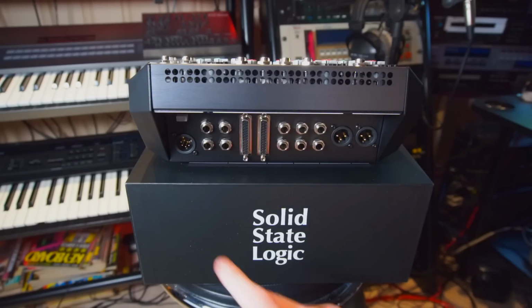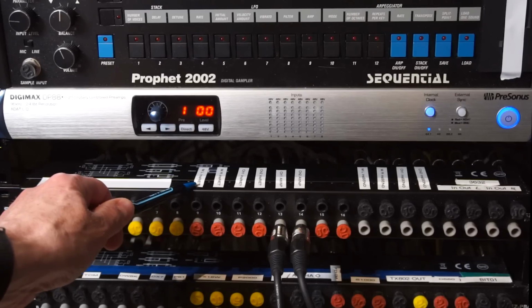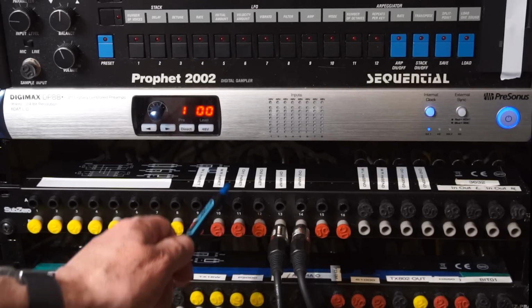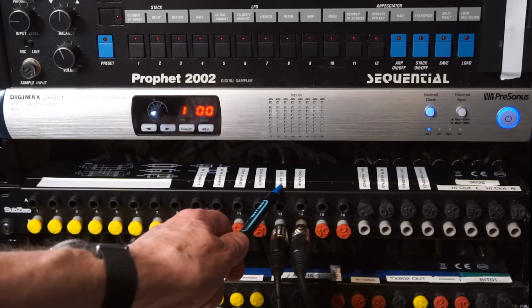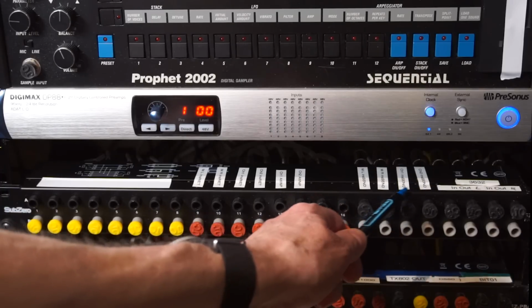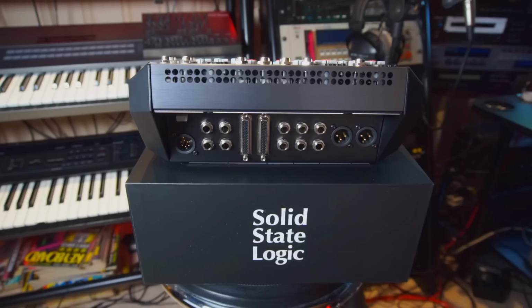And that brings me to the back of the SSL SiX, where most of the inputs and outputs are going through DB25 connectors. And I have hooked those up to my patch bay. And that means I now have easy access to the sends and returns of my main channel, left and right, as well as my channel inserts and returns. And those alternative inputs, which you can see I have actually hooked up here. To the left of the DB25 connectors, you can see the 2 auxiliary stereo sends. And you have monitor outputs and a B-bus output and the main bus output on the XLRs there.